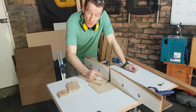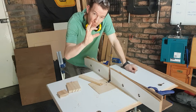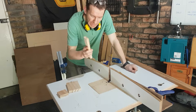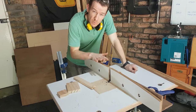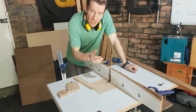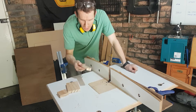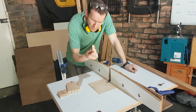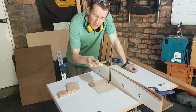I ended up needing to switch out my good new router bit for my old 12mm router bit because of the length. The new 19mm bit was only 19mm high, and at a 45-degree angle that's too short to make the correct bevel cut. This longer one works. The way I'm doing it, I have to be careful because this is one of the rare instances with a router table fence where you do need to be roughly perpendicular to the bit. My test pieces are starting to come out well — that's about the depth I need them to be, and I'm going to do it in several passes.